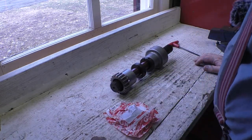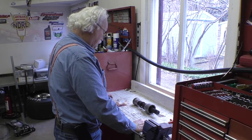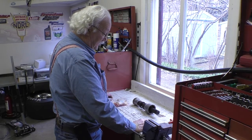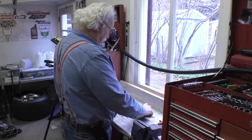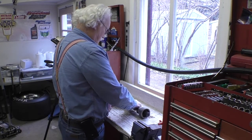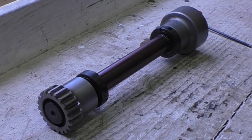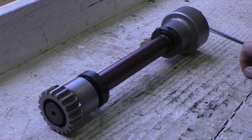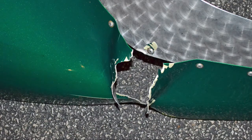This is what you could call a drive shaft, but it's really a coupler. The way the dragster is set up, the rear end is in direct line with the output of the transmission — there's no universals, just couplers. We had an incident at the second to last race at Gateway where one of these let go and the coupler came flying out and ended up going through the cowl on the dragster.